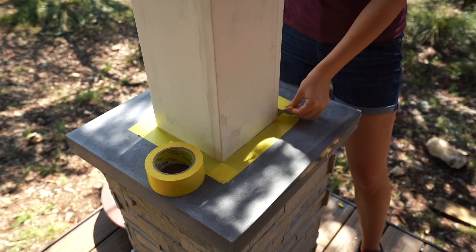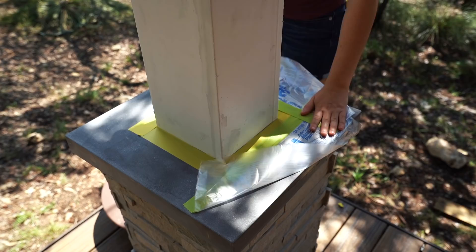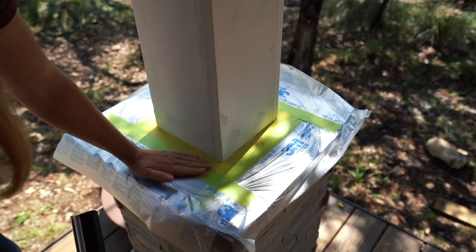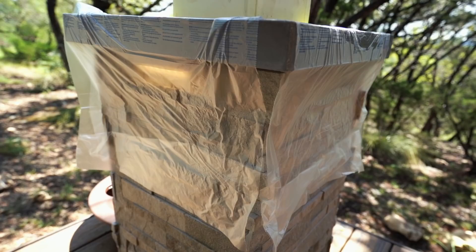On areas open to the sun and rain, I use Scotch exterior painter's tape, which is made from poly rather than paper and has a strong weatherproof adhesive. Unlike standard tapes, it stays put through rain and doesn't break down with sunlight exposure. I needed to tape off the concrete to paint the post boxes, so I first lined the post with the weatherproof tape, then used the 3M hand masker and advanced masking film to protect them. The system is super fast and easy because it automatically applies tape to paper or sheeting, and the film is charged with static cling so it hugs surfaces and stays in place.